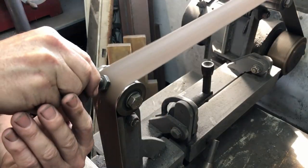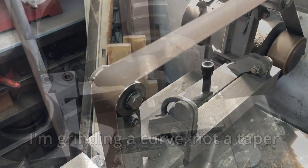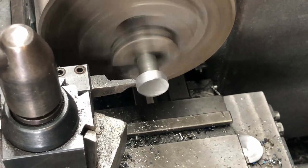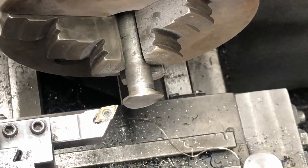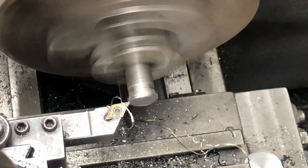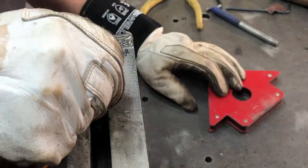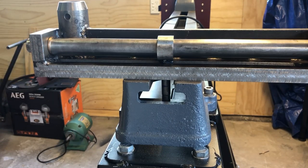Now there's a thread that needs to be welded to that, and I use a bolt and grind a bit of a taper on it. I find out that the bolt needs to be taken down on the back side a bit to fit into the mechanism, and then it turns out it's quite thin so in the end I just turn that piece off. I still have a bit of a curved face on the bolt so it can be welded onto that round ring. And that's how it works — up and down, tighten it and loosen it.